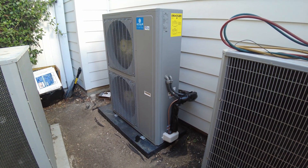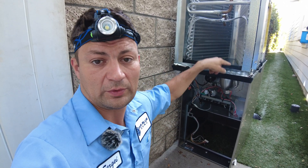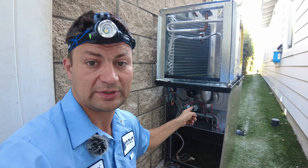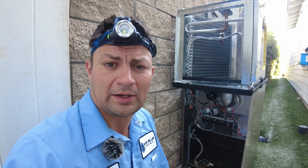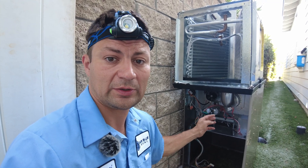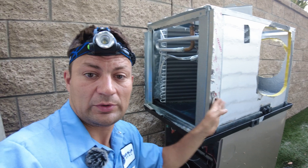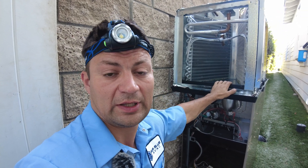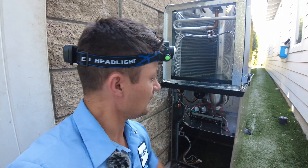Let me show you the new inside components — the other two components of the system are the gas furnace and evaporative coil. We will be replacing the existing gas furnace with another gas furnace because we simply cannot get our hands on air handlers this summer 2022. We'll use it in air handler mode — we're not going to connect the gas line or the flue pipe. As for the evaporative coil, we'll replace the existing duct board evaporative coil with the same type, but one that has a heat pump TXV installed, to ensure refrigerant can go both ways inside the new system.